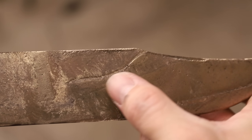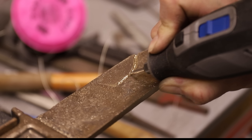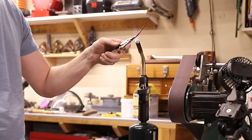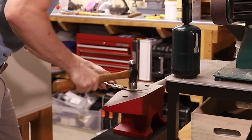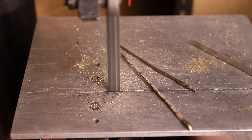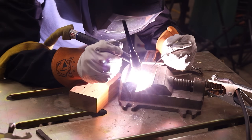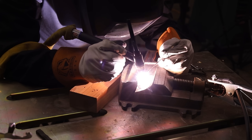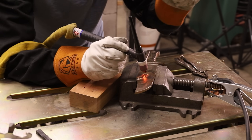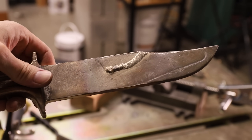The rest of the knife is completely solid except for one area, which is called a cold shut — it's where two pieces of molten metal came together but didn't quite mix before they solidified. So I'm going to weld it. Before I can weld it, I need to make some welding rod, so I got some excess metal from the casting, hammered it out, cut it into strips, and cleaned them up with a little bit of acetone. The weld turned out pretty solid, so it should hold up just fine. Now I need to start cleaning up the blade.